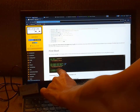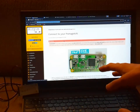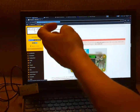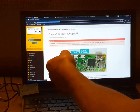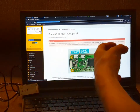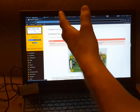You're going to whitelist your network so it's not going to deauthenticate your own devices, because that's what the Pwnagotchi does — it uses artificial intelligence. It goes around sniffing and looking for networks to essentially do an ethical pen test. It deauthenticates devices on those networks, which forces them to reauthenticate with the Wi-Fi network, and in that process the Pwnagotchi is sniffing for handshakes and picks up every one it's able to grab. When devices are further away you might actually get more handshakes because they sometimes have to send multiple authentication attempts.